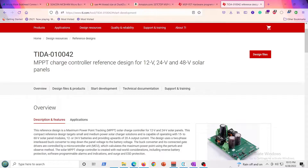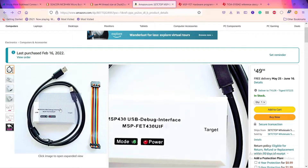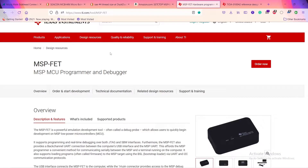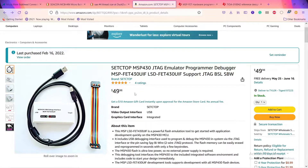Today we're going to upload the firmware onto it using Code Composer Studio. We're working with this board here, and we're going to program it with this — a replica or Chinese knockoff JTAG debugger/programmer of the actual Texas Instruments MSP-FET programmer. This one sells on Amazon for $50. It comes with the debugger, USB cable, ribbon connector with 14-pin headers, and a CD with some software — all in Chinese though.